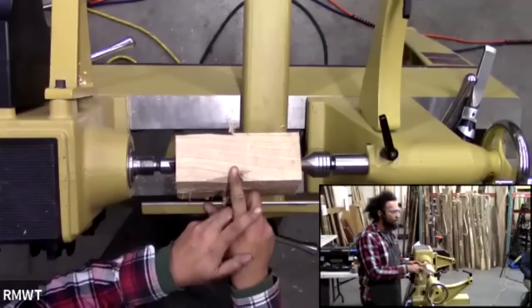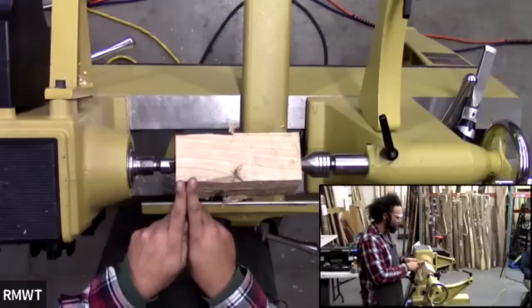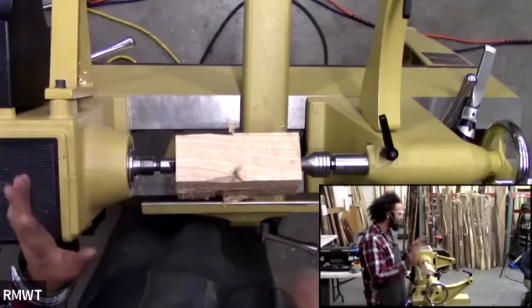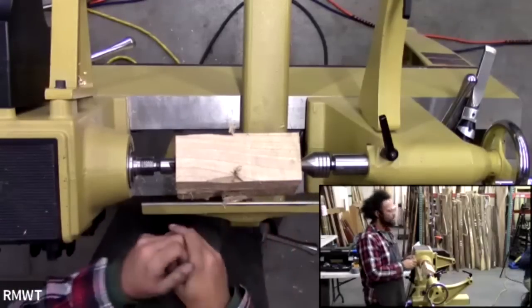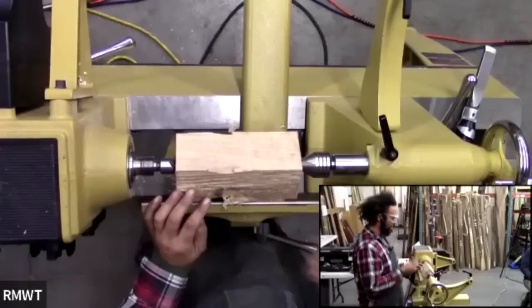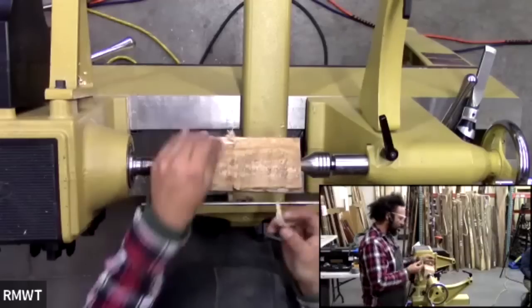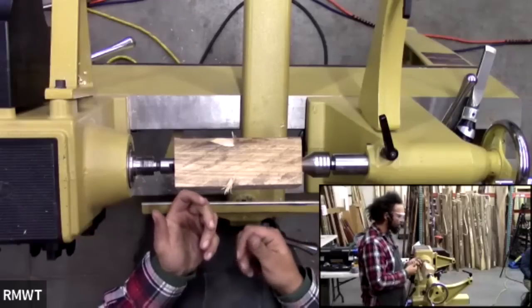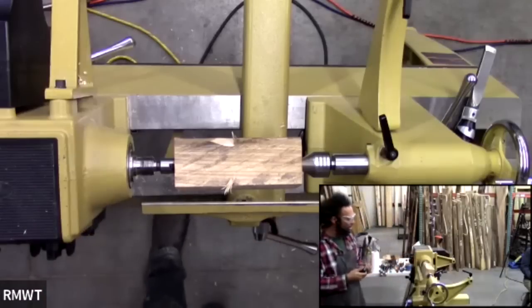So it would follow suit that if I am going to use a skew chisel and I'm between centers, I shouldn't start at the center. Rather, I should start from the left and make what Raffin would say, he uses terminology such as scooping cuts in his old videos, to the left and moving my way in, or start to the right and moving my way in. So that's what we'll do instead. If you then take the fiber and peel it back that way, then you can see what's going on. So nice, isn't it? No, it's not. If you see this and you make these kinds of cuts, or this kind of a shaving, it doesn't lend itself to make you feel confident using a skew, or that it's something you're going to want to use. So let's change our perspective on that maybe.